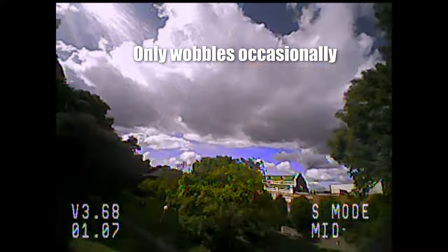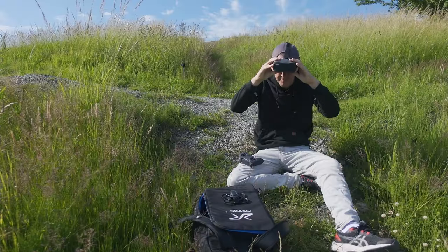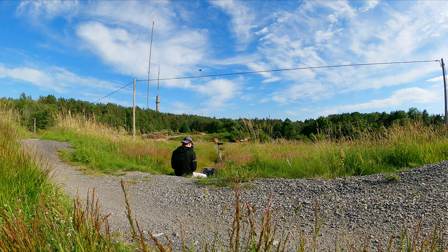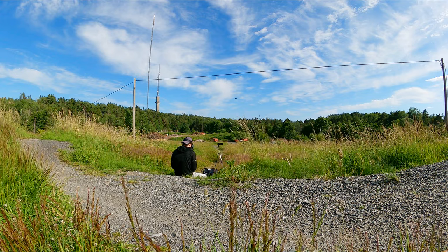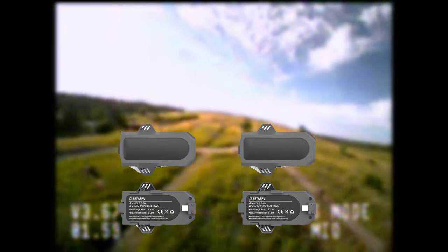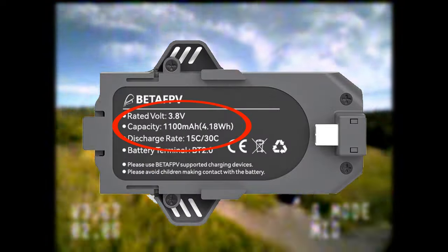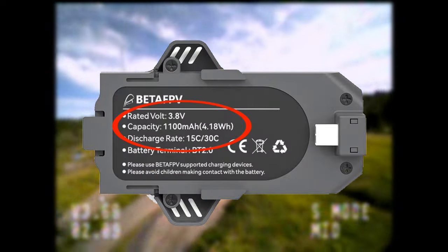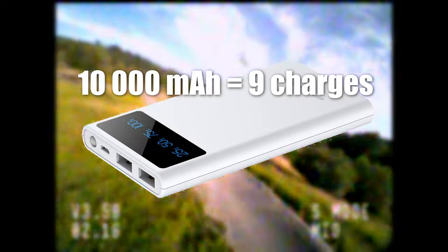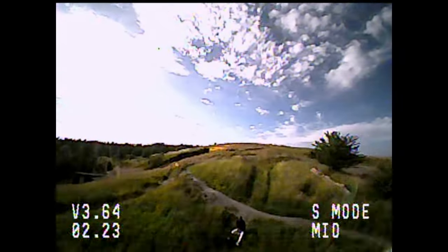Wiser and a somewhat better FPV pilot, I go to a mountain bike trail to further polish my skills. I only used the 25mW transmission setting, but the image is fine anyway, even over 100 meters away. I'm still fighting the wind and struggling to follow the trail — this isn't easy. Having four batteries is almost a must, even with a power bank to charge between flights. Each battery is around 1100mAh, giving a flight time of around 6–8 minutes, which is plenty in the FPV world. Charging takes around 30 minutes, and you can't charge two batteries simultaneously with the included charger.